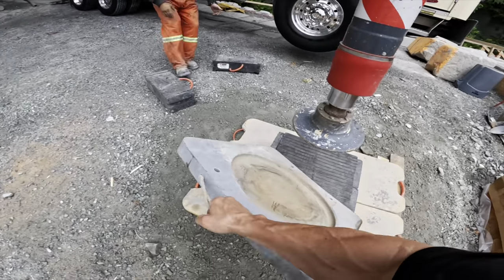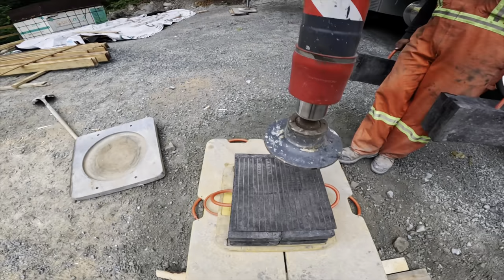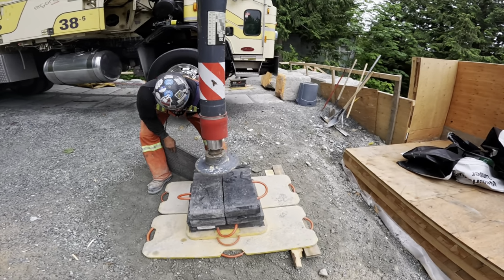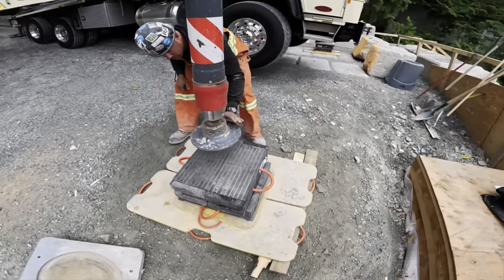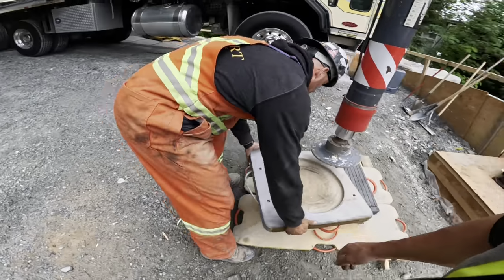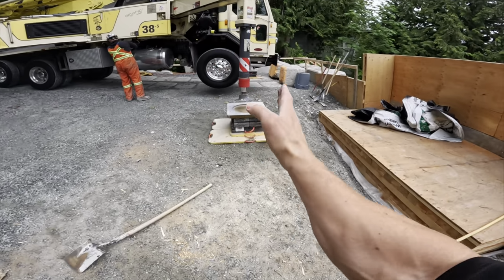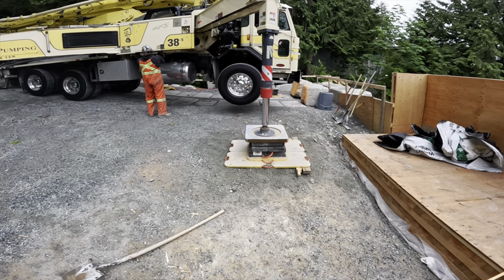Cool. And then same thing, we'll position this stack as such to take into account our outrigger walking forward when we load it up. So we'll start off with the outrigger foot towards the back of the stack slightly. Maybe slightly more, we'll pull it ahead just a hair. Like that, that's pretty good. These up together because my OCD says so. Good. All right. Now watch when he cranks this up, that leg will walk forward a bit. It should center itself up perfectly on that stud. Excellent.